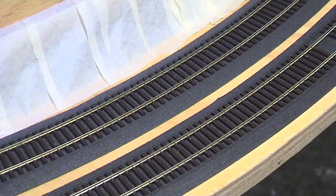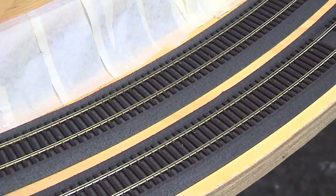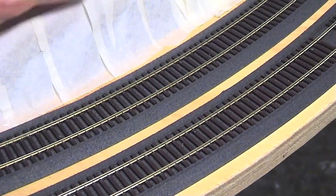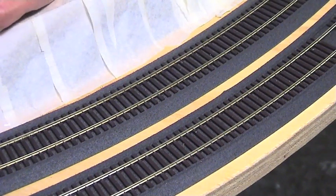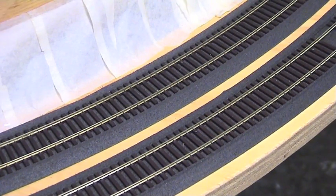At a lot of our level crossings, or grade crossings as you Yanks call them, we actually use AC track circuits because it helps in areas where there's not a lot of trains and the rails are a little bit rusty. The AC helps pulse and shunt the track, so the boom gates will drop and the lights will flash. So in areas where there's not a lot of traffic, you will find most of the track circuits are AC. So there you go.